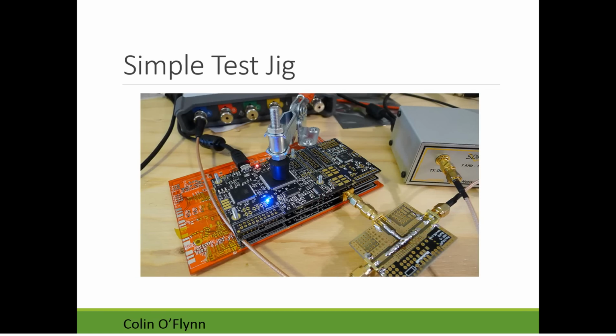So in this example, I have the board under test on the top here. And you can't see it, but there is basically these pogo pins are contacting a number of connector points here. And then you have something like I'm scripting various tools. So there's an oscilloscope in the background here. This is used as a RF signal generator here. And these inputs are wired in through the system. So it's not, you know, an insanely complex thing to build, but with something like this, you can perform that level of validation testing that you need.